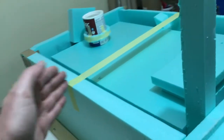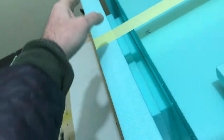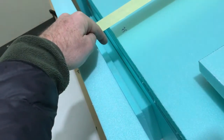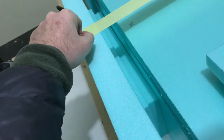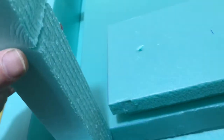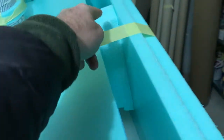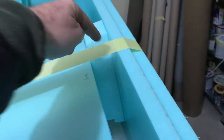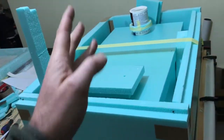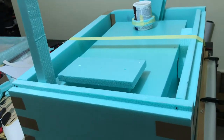So now again I'm going to make my mix, fill the gaps. I'm doing a side entry pizza oven, so this will be my opening for the pizza cover, let's say. As I'm going to remove this, it is just for me to have this box in the center, so I know that I'm at 5 centimeters all over. So I'm going to make my mix now and pour it in, and let's see how it goes.